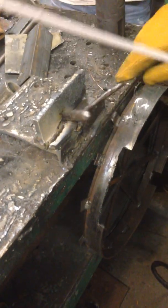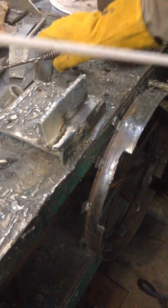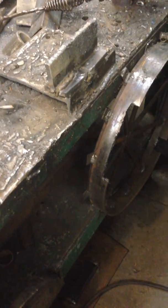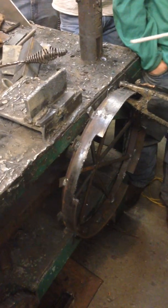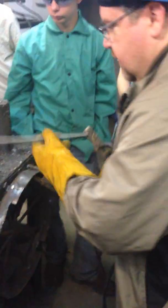Now before we restart, we need to chip the slag. Why do we need to chip the slag off before we restart? Porosity — worm holes and everything. So as long as we've got a little spot cleaned off where we're going to start back, we're good. Actually, I need a little more amperage. Take it up to about 119, 120. I'm actually welding 3/8 inch steel — I told you 1/4 inch. This happened to be 3/8 inch, so I'm a little too cold. I want good penetration here.